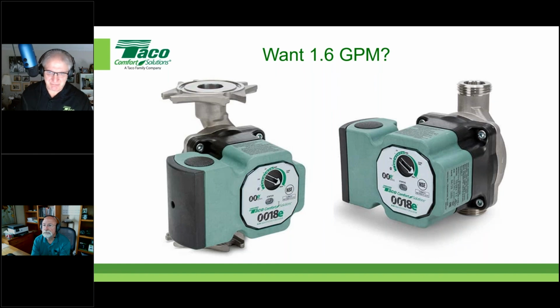And I think they should, because timers and tankless are a deadly combination. Forget about causing the sprinkler system to happen out there in the home. We're going to burn out all the moving parts of that water heater and void the warranty. So you want to make sure the tankless that you choose follows their guidelines and their own internal control strategies for domestic hot water recirculation. That's really the best way to go there. And again, they're taking control of it because they need to.